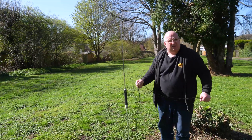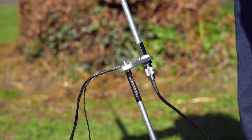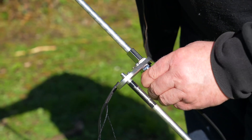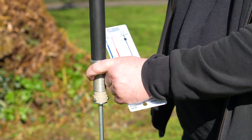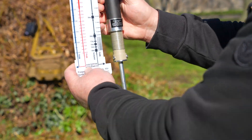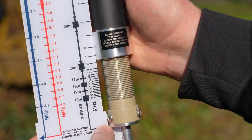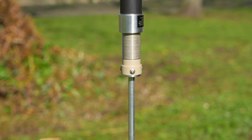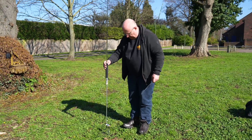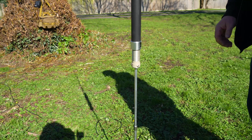Now comes the bit where we've got to tune it. I'm going to lay these out and come back to tuning the antenna. I've laid all the counterpoises. I've just taken this out of the ground, going to connect the feeder cable here, like so. With the whip fully extended, make sure that's tight. You can just pre-check this here — we've got that at approximately 14.2-ish, give or take. We're going to put this somewhere pointing straight up, looking near enough vertical, and just give that a little push in the ground. And it goes off at a weird angle.